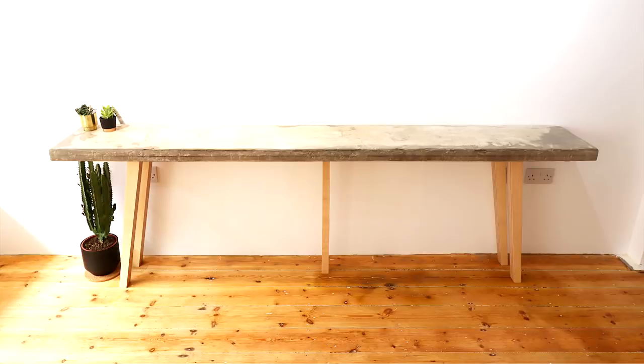The second table was about 2.4 metres in length and couldn't be mounted via a batten to the wall because a rug was going to be mounted there. Even though the concrete was reinforced with steel and had a frame with thick MDF bracing, there was still a bit of flex in the centre, so I was asked to make one additional straight leg to support the middle of the table. I didn't film that one — aside from being straight rather than angled and tapered it was pretty much the same as the others. That one was made from two pieces of 18mm birch ply laminated together, so basically 36mm square.